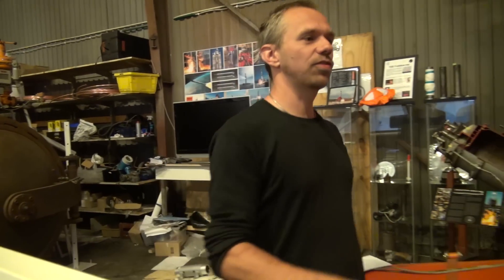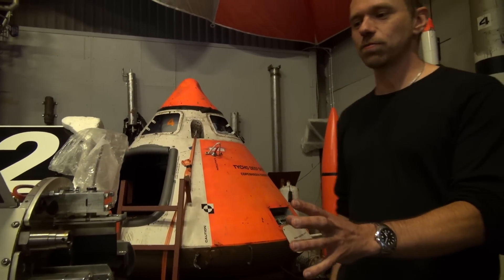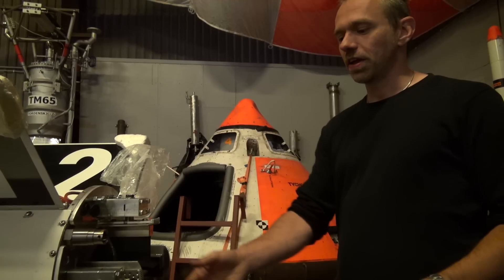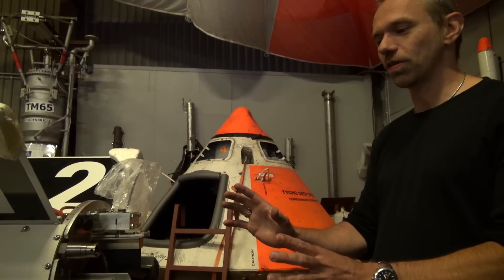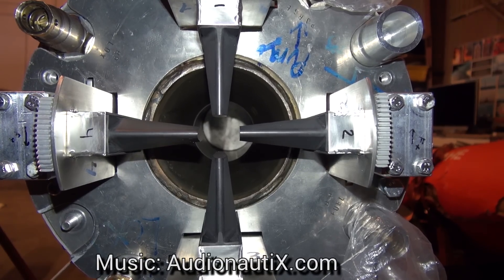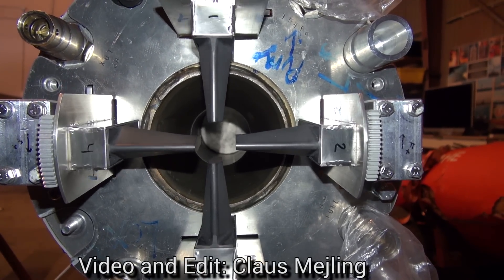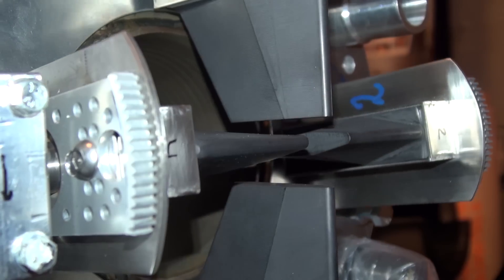So, at the end of the day, what the computer should do is to move the jet vanes here at the other end of the rocket. We have been video filming this from behind so that we can look at the data and look at the video and ensure that we don't have any wires crossed or any signs wrong — that the jet vanes are actually deflecting in the correct direction to make the correction to the rocket that corresponds to the artificial data I have injected.